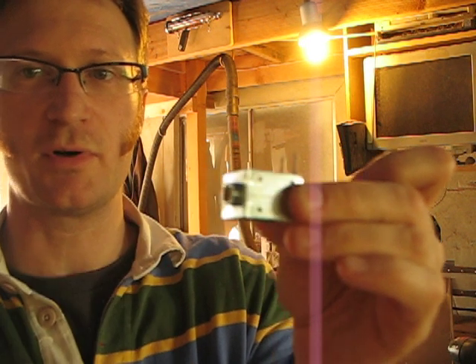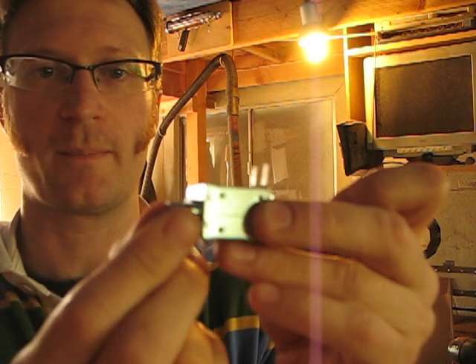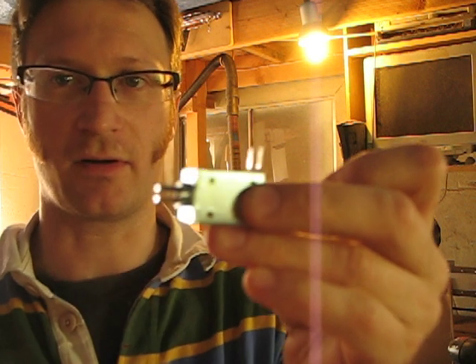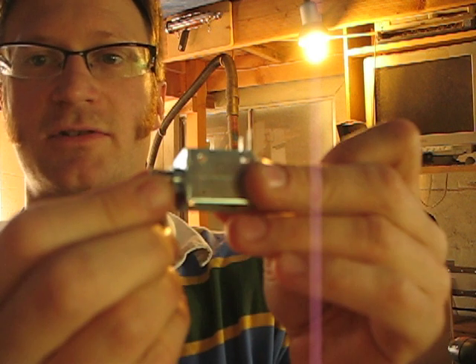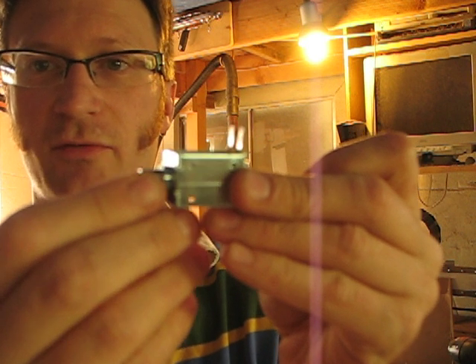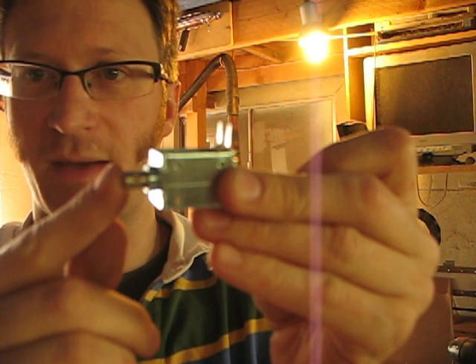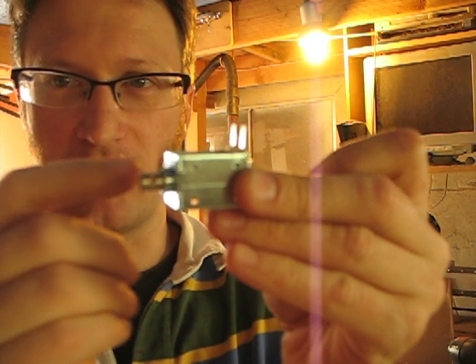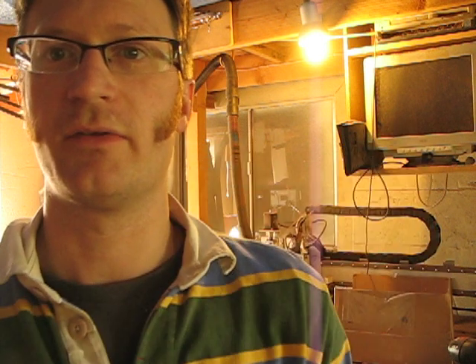There are some types that are pushed solenoids, but this one is a pull solenoid — so it pulls inward. Solenoids are great things; they can have quite a lot of pull in a small space. However, the trouble with solenoids is that their stroke is very small. If you want to get the full power of the solenoid, most of that power is right when it's almost all the way in. As you move farther and farther out, it has a lot less power. So what I'm going to show you is a way to make another linear motion using a small DC motor.